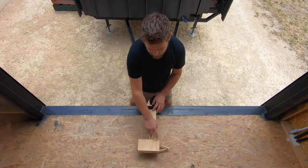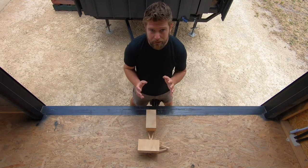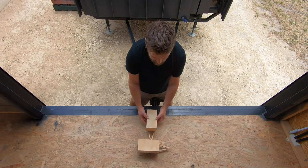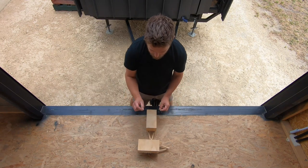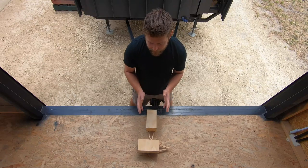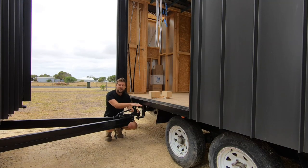The challenge of getting these trailers perfectly square is difficult, but it's not too hard to get them pretty close — within a couple of degrees. Because we're working over such long distances, if the trailers are slightly out it only changes the length of these walls a little bit, and the deflection — how straight the wall is — shifts only marginally. I've actually allowed for that in the design of how the walls nest into the side trailer.